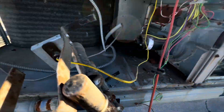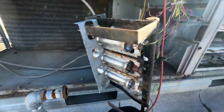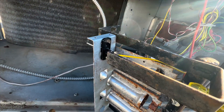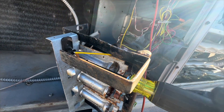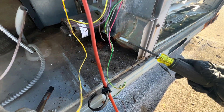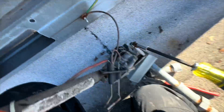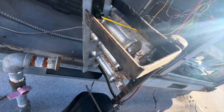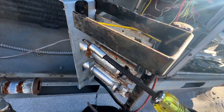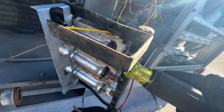We're supposed to have igniters and burners to replace these burner tubes. This is a flame sensor right here — I'll pull that off. This went to common on the gas valve, the red went to high, and the gray went to M. Just saying that now so I don't forget. You can see there's rust attached to the screwdriver — just how bad a condition this unit's in.